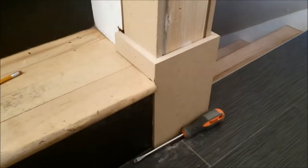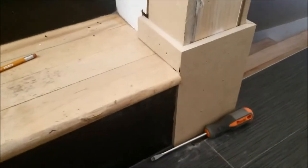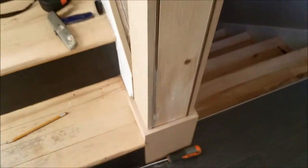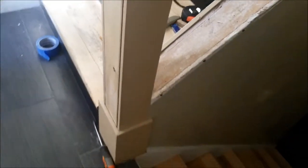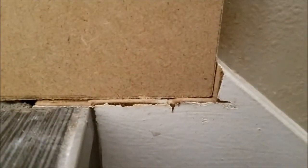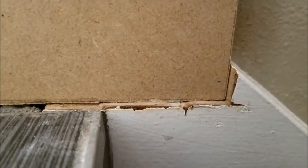We got the foot built. We had to cut this little bull nose part of the wood off and built the foot there with some MDF. We built a new square post. My good friend Chris, who's excellent at working with MDF, helped me make the cuts and helped design this — he knows what he's doing. We had to cut here with a little jigsaw and fit it in there, and we're going to paint and caulk it to hide that cut.